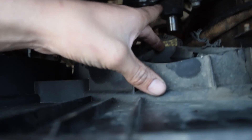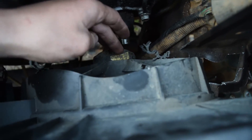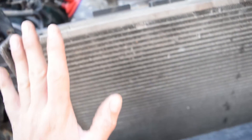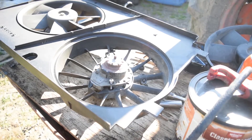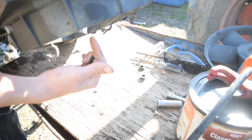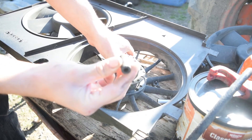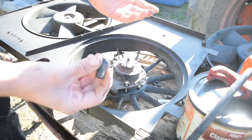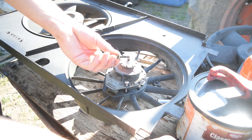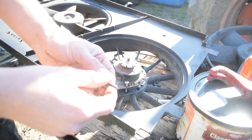So I think what I'm going to do is space out the fan motors themselves in, because they still have over an inch to go down in there. I'm going to see if I can space them out with some longer screws and spacers. This is how I'm going to get the fan motor to sit more flush with the shroud. I got some fuel line and I'm just going to use that as a spacer. The stock screws are about this big, and the ones I just got are about half inch longer than it. So it should work — it doesn't need to be spaced out too much.